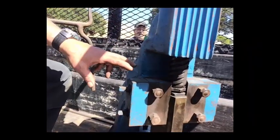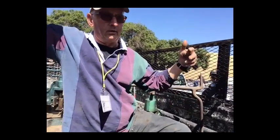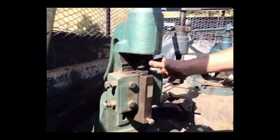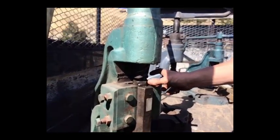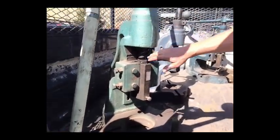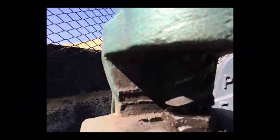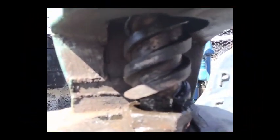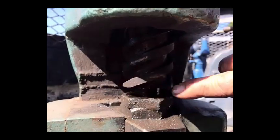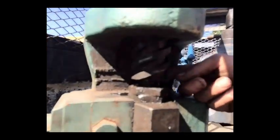What makes it a number eight? Most manufacturers number them. With the English ones, as a rough guide, a number four would be a four-ton press, a number six a six-ton, and so on. This lead screw, which turns inside the frame, also determines the force — obviously the thicker the lead screw, the more force it generates. The pitch of the threads also makes a difference. You can see the spacing between the threads; these are called starts. On this one you've got three starts.